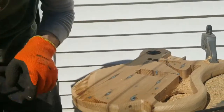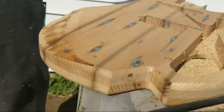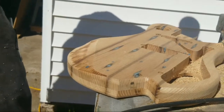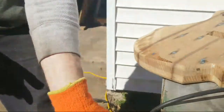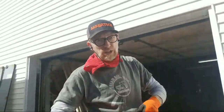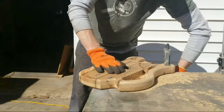I'm not going to do that today because this pad is shot, as you can see — it's starting to burn it because it's a little shot. I was just grinding on the truck a few minutes ago with it. But that's really all there is to it — that'll clean up real nice. I'll sand it with that angle grinder sander, and then I'll jump right to like 80 grit sandpaper. So let's do the back belly carve.